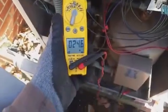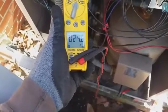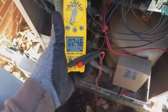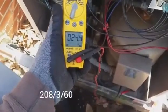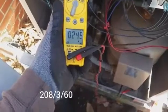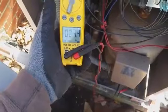Larry Cole, this is for you — this is the amperage on the compressor running right now: 24.6 amps. No doubt this will rise up a little bit before we're all said and done. We just went back into heating mode — I say that and it goes down. But I think the rated load amps is 36 on this one.